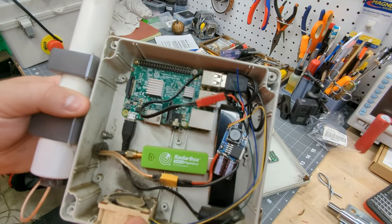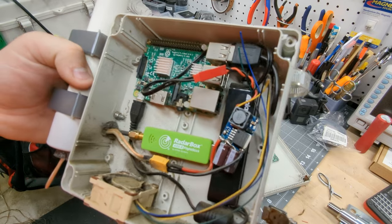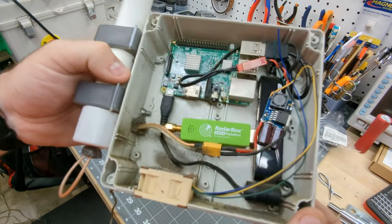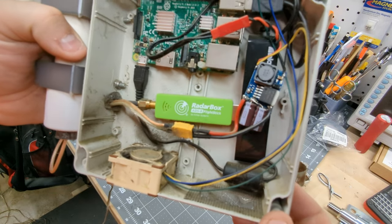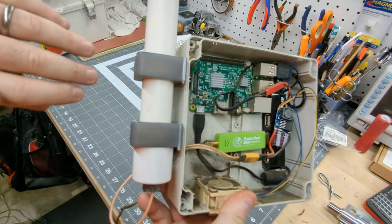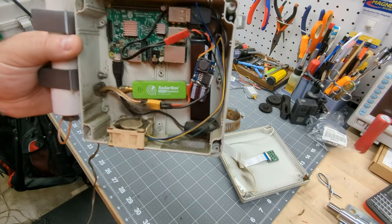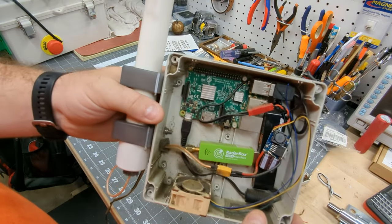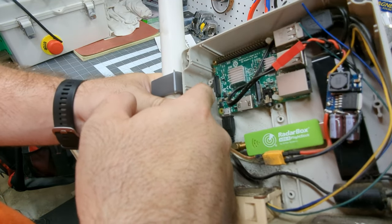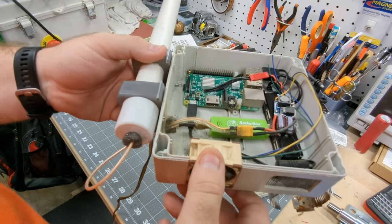The layout: I have a Raspberry Pi running to a USB hub, and both the hub and Raspberry Pi are powered independently off a 5-volt regulator, fed by 12 volts from a power supply down inside the house. Those RTL-SDR dongles — including radar box dongles — suck up a lot of power and will brown out the Raspberry Pi if you're not careful. It was a quick weekend project but it held up really well, and after three years there's no corrosion, which tells me it's been pretty dry in there.